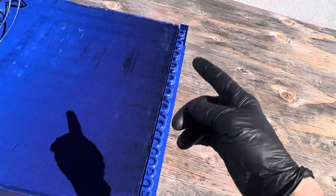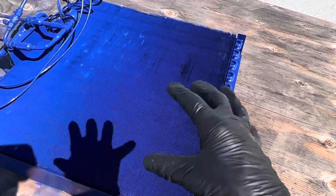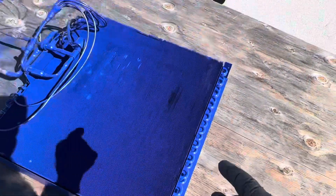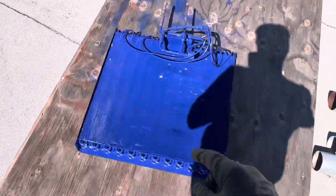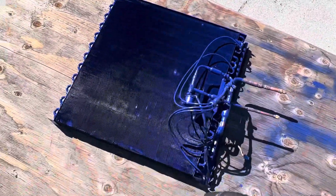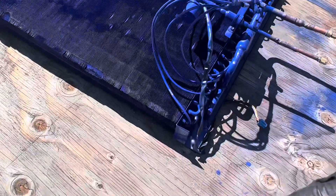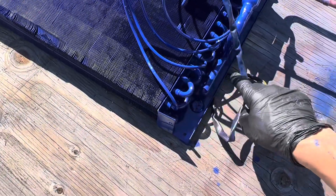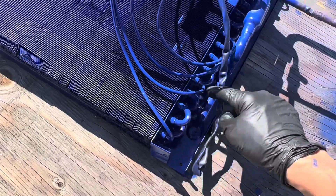The galvanized was doing its job, but on all these coils that are manufactured, they're made with cheap galvanized — usually electroplating, super thin, basically worthless after a couple of years. So they don't do their job, and that's why you get leaks at those points right where it meets.